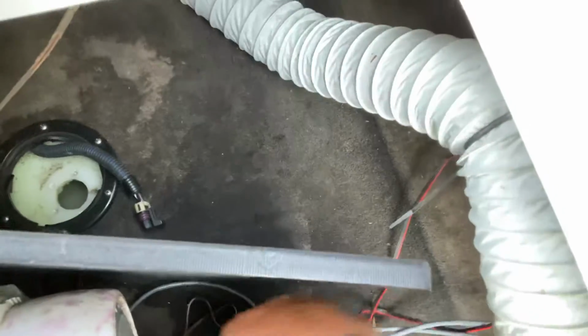So anyway, I've replaced 2 of them now. I had a little bit of a problem with the gauges, but if you take them off and fiddle with them, they work. Here on the starboard side, you've got your subwoofer, and right behind the subwoofer is a hole for your starboard tank. That has this 3-wire gauge, and there's a little cover that goes over it right here. Take that cover off, expose your wire, and take off the old sending unit. In this case I chopped off the ends of mine so I could reuse the existing wiring with the new sending unit, and this will plug right in. The new one doesn't need power, so I just terminated that one.